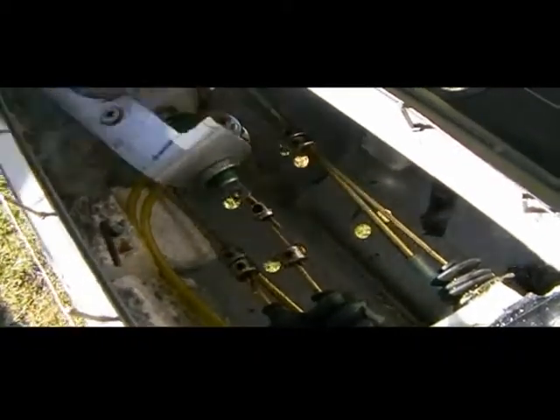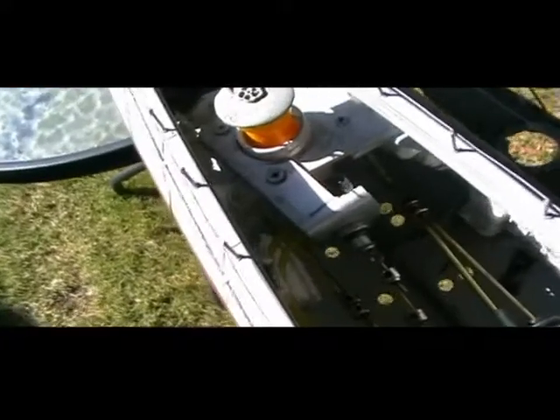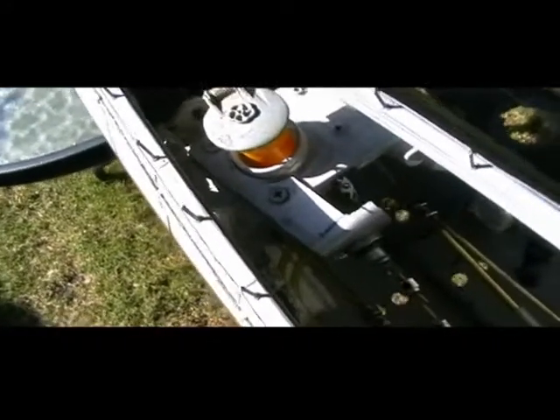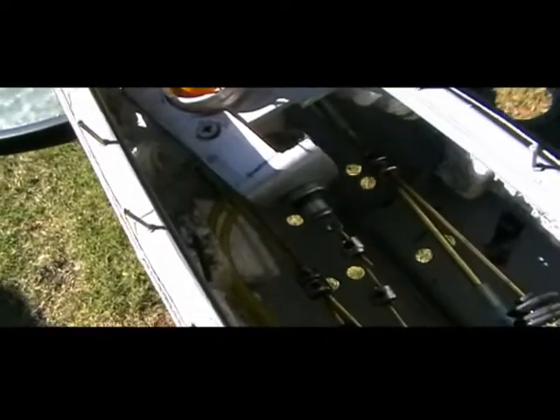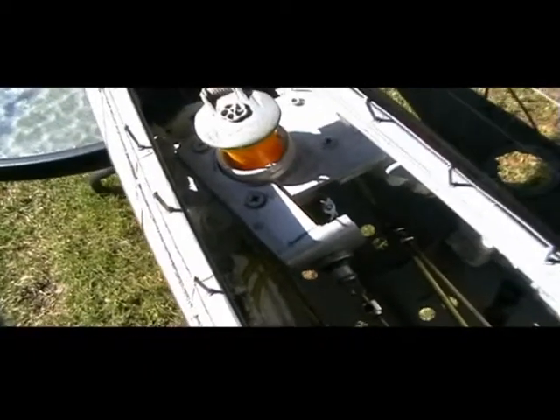The emergency gas system, which I showed you first, is operated by this valve here. The valve is also connected to a pin which, when released, will set the emergency buoy off, and the emergency buoy will float to the surface. There's a 50-pound breaking line on that, tethered to the hull, so if the boat does get lost, it'll come up and I'll know where the boat is. I tend to believe boats normally bump into things head first, so if it gets caught on or under anything, the stern will still be hanging out and the buoy should be able to pop to the top.